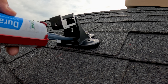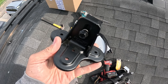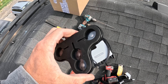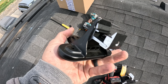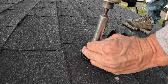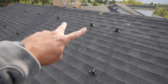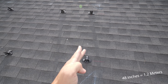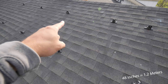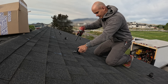Since we just put two holes in the roof, we're going to put some sealant around the edges of those bolts. The feet have a little channel so as we inject the sealant into the back, it goes between and around the holes we just made, keeping the shingles watertight. Here in Utah, the maximum distance between two of the feet is 48 inches, so we have two at the end of the panels and then stagger the rest of the feet lining up with each of the joists underneath the roof.